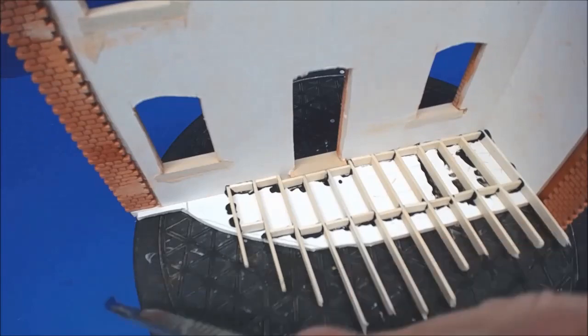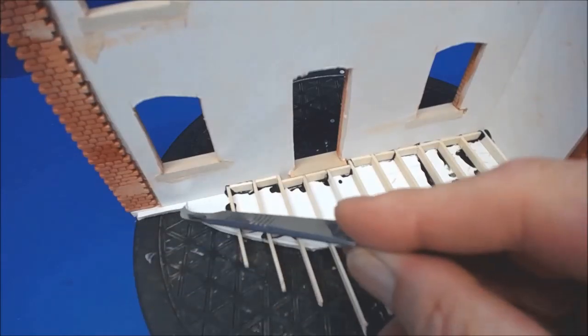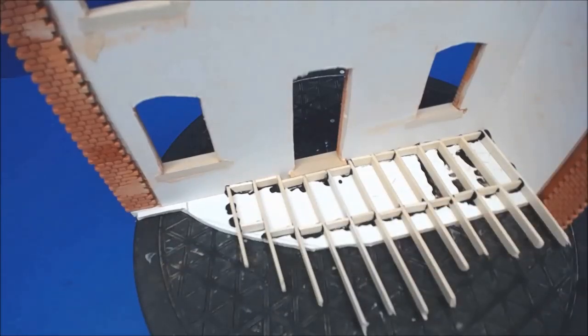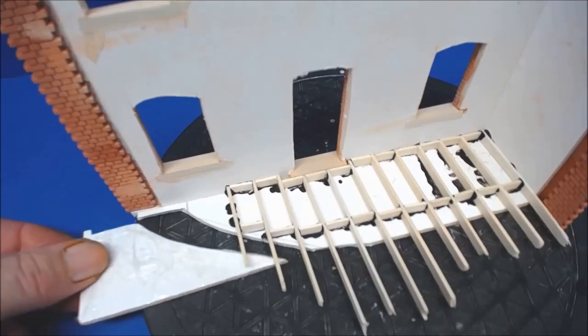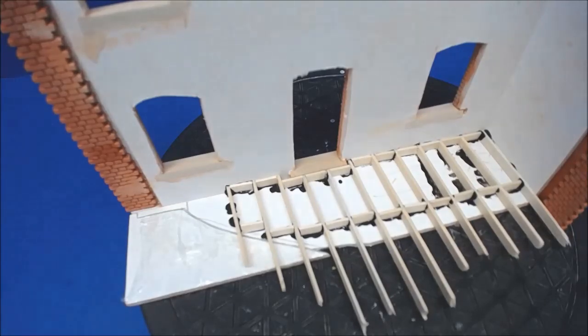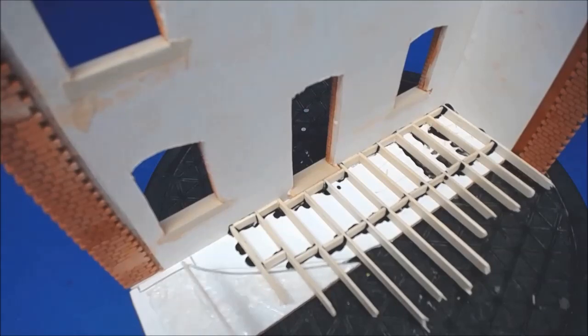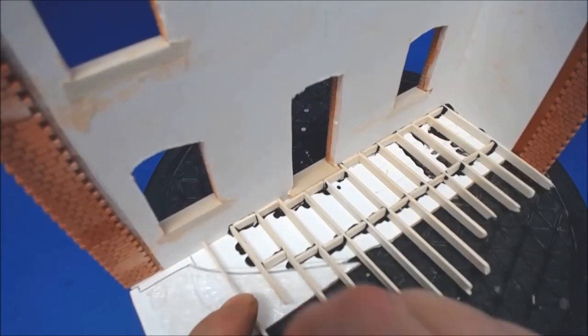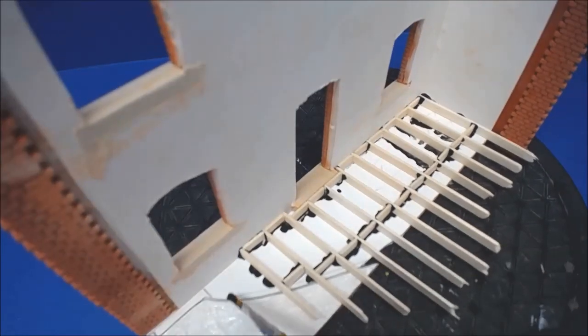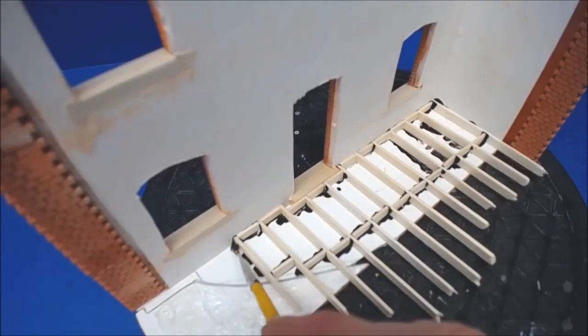Now, the piece that I actually cut out, I left a small little lip to allow my spacers to sit on. I've cut the shape out, but I've kept the piece and I've given it one wrap of cling film. Now I'm just going to slide that piece back in like so. Now what I'm going to do is still do my spacer, joist, spacer, joist. So we're just going to continue that on, if I can just show you. So we're still going to break it off like so, and we're still going to put a spacer in there on the end,